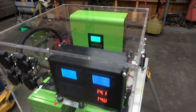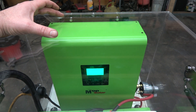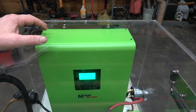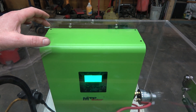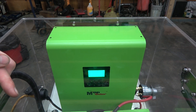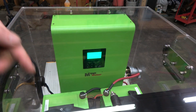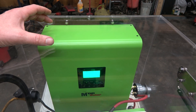Let me bring you in a little closer and show you what I've built. We'll start with the inverter. This isn't just an inverter — it's made by MPP Solar and it's 2,400 watts, which is 20 amps at 120 volts. It's also capable of split phase, so 120/240. It's also a solar charge controller so you can hook up a solar array to charge the batteries. It's a grid-tie inverter so you can back-feed your utility and offset your power bill. It can also take 110 volts in and charge the batteries from that input. A really neat all-in-one unit with all the features I needed.